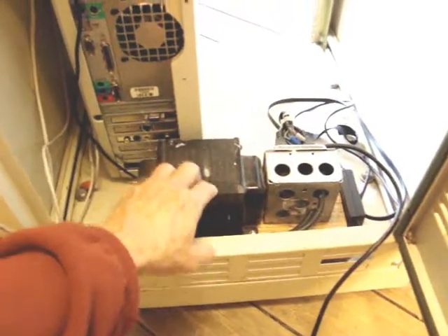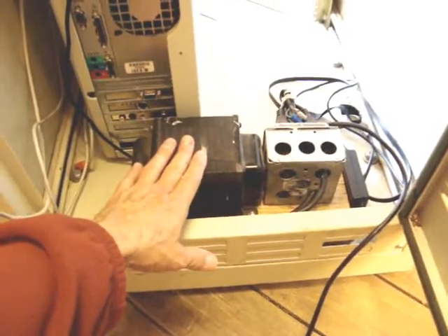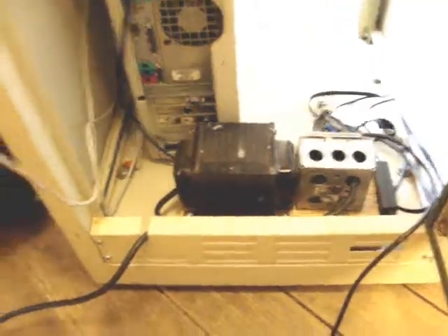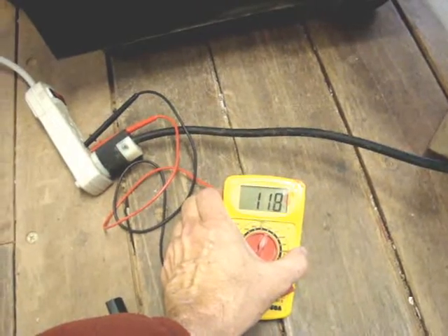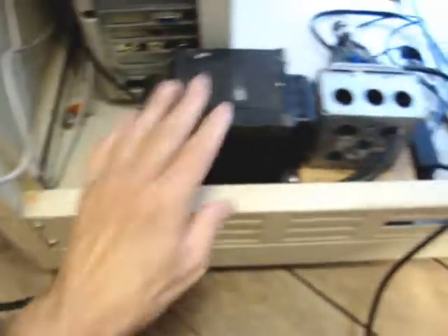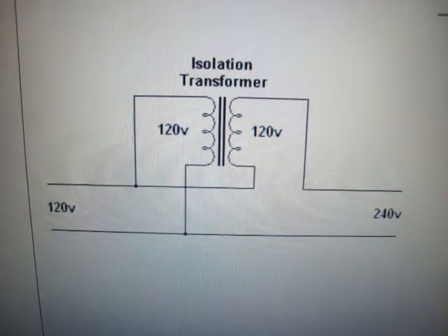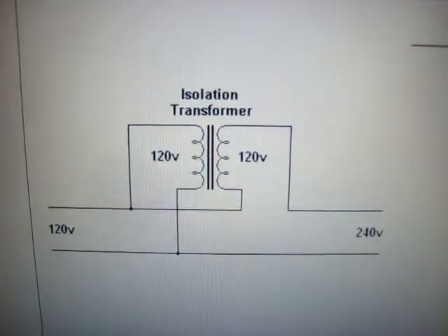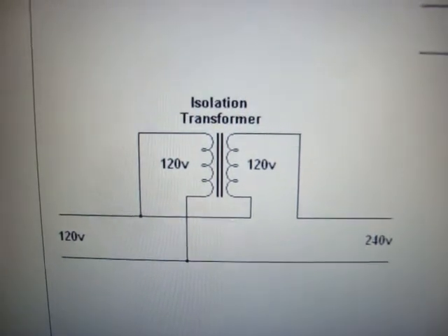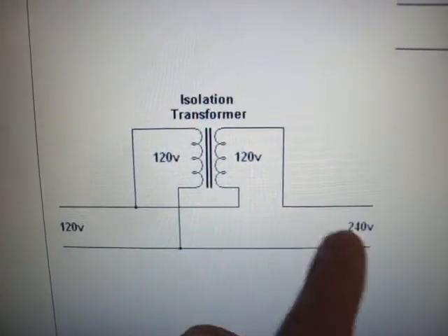Here is the one-to-one isolation power transformer, good for about 700-800 watts or volt-amps. I've wired this up in an autoformer configuration. We power off 120 volts, 120 goes in, and wiring comes out here into this EIA connector, and we get 240 volts. Here's a diagram of the isolation transformer wired in series-aiding — basically making an autoformer out of this for the transmitter. If you need to step up your 120 to 240, this is basically the way I did it — you had the secondary in series with your output.